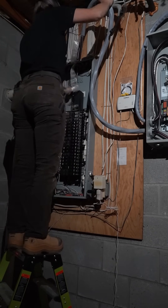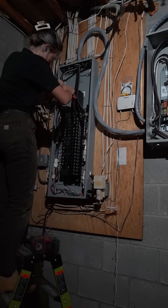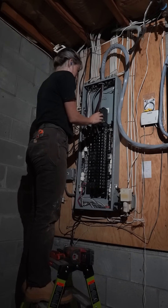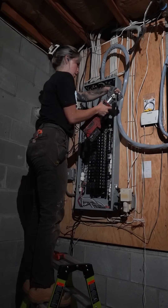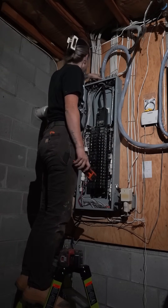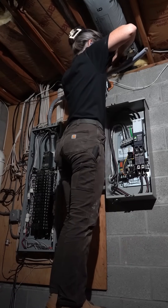Whoever did this panel did it really nicely. It's a newer home, so thankfully they actually separated the grounds and neutrals, though they were still bonded together as the main source of the disconnect. Now the new main disconnect from the utility is the transfer switch, so this is technically a sub-panel — it needs neutrals separated from grounds. A lot of people don't know that, and I've run into issues with other customers' homes where generators aren't isolated, which is a huge problem. I took out the bonding bar and moved the one neutral that was on the ground side.